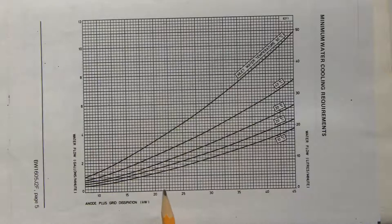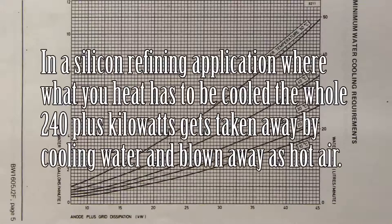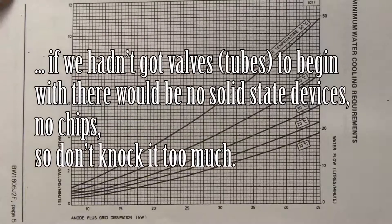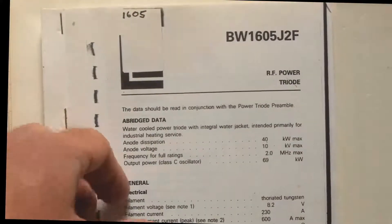I can't remember the actual figures I used now as this is going back a long time. Some of the problems had more to do with the cooling water. I learned that a bucket of water is a bucket of worms when you keep circulating cold water that gets warmer and warmer, and subject it to electrolysis. All sorts of things happen — it dezincifies the brass, it separates the water, and brings many other problems.